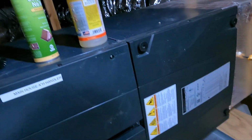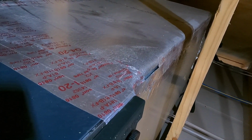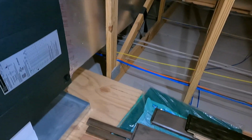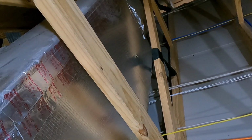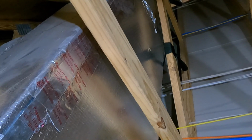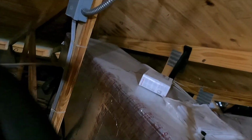We're gonna go ahead and check the static for the system while we're up here. So while I wait on these, I'm gonna save some camera battery. I mean, that looks pretty good. 70. It's kind of holding, so move on to our next temperature here using another spot that's already been used. I'm going to go ahead and throw a manometer probe in for my manometer, in the direction of the airflow, or the best I can. All right. Go ahead and throw the supply one in.